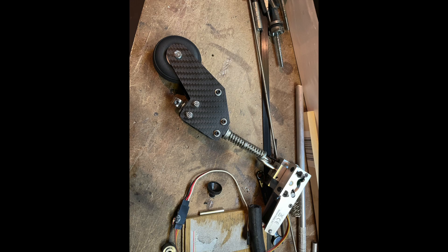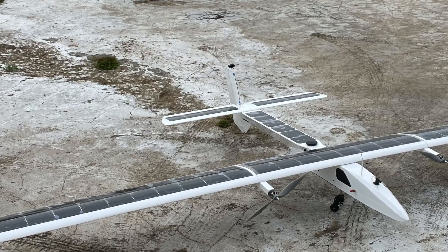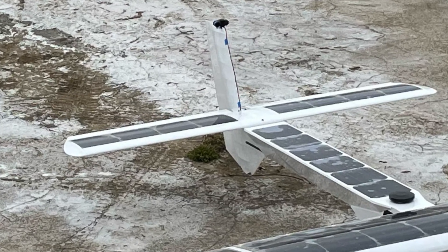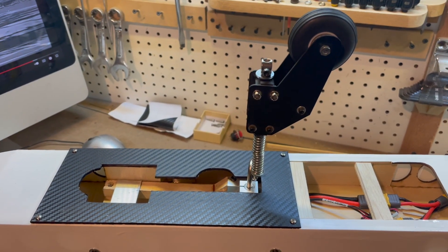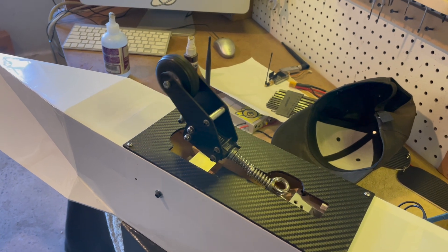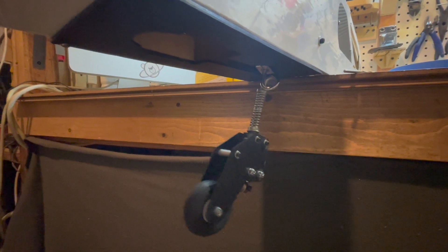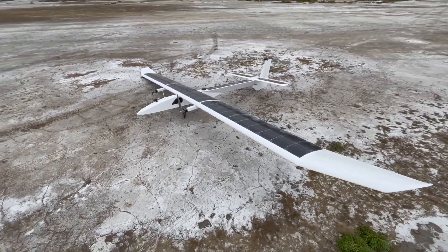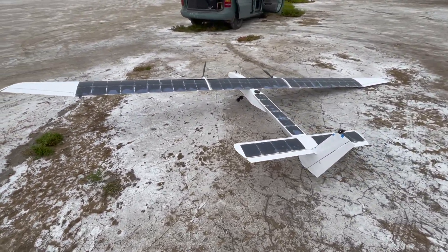The landing gear was a challenge in and of itself. We didn't really want any landing gear, but with the Crucifix tail being vulnerable and with such a large airplane we thought it best to use some sort of gear. After some thought experiments we decided to try a single wheel retractable on a full caster, counting on gravity to swivel the wheel downwards when retracted to allow the gear to fully retract. It did add about 200 grams to the plane, but it looked cool and even if it failed it would provide a point of failure and perhaps absorb energy, saving the airframe from damage on a hard landing.